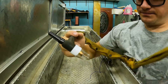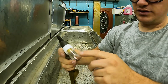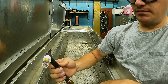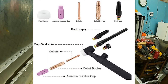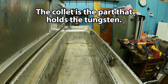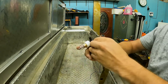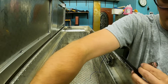Here's the new setup on the TIG welder. It's got a stubby setup here, a wedge collet, and then this clear quartz cup so you can see through it. The whole thing is probably four and a half or five inches shorter or lower profile than what was on there before. It's just a lot lower profile, as you can see. I'm not sure how I'm going to like this — I might switch from this quartz cup back to a ceramic cup. I don't know if I'll like how bright it is, but it might help you guys see better.